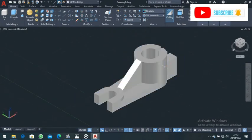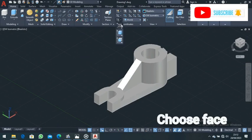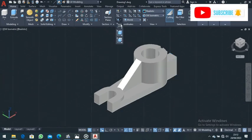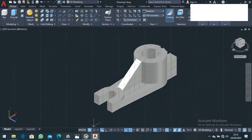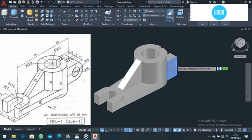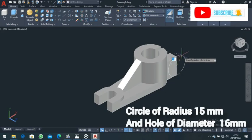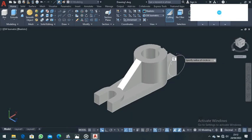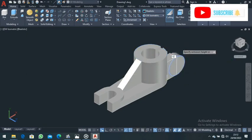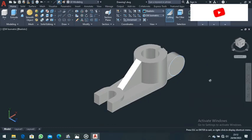Go back to Southwest Isometric — that's what we have. Come here and choose this face, then choose this face again and press Enter. Switch the grid off. We are going to draw circles. This circle is already diameter 15, so take it up for a distance of 15. Come to the Press Pull command and press pull this circle in for a distance of 13, press Enter. Then rotate your work.